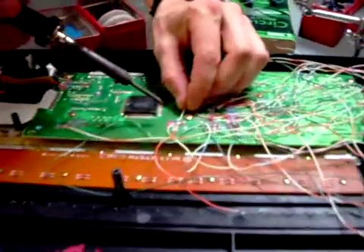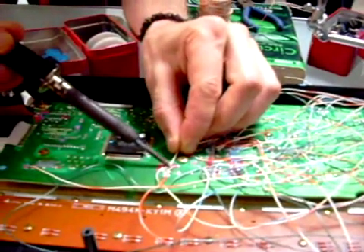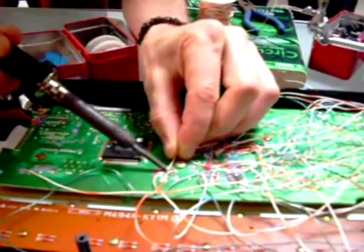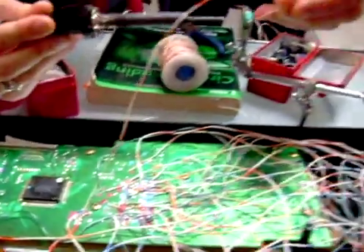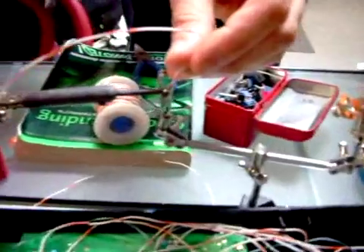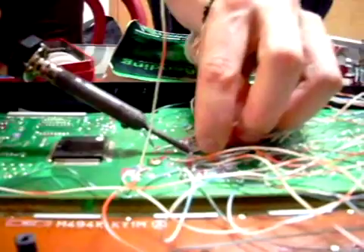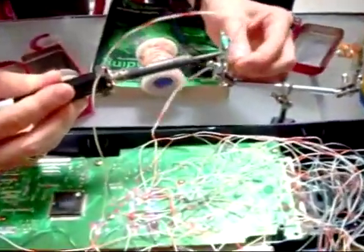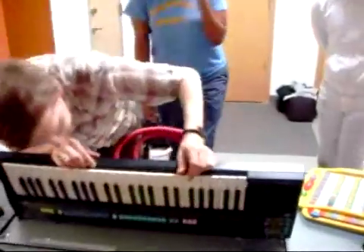I'm going to go back to point one. I'm going to reheat the location, bring the solder — there we go — bring the wire in, right there. And now you can see that it's hardened and solidified, so we've got a good connection. So now point one goes to one of these feet. I'm going to do that one, and then go back to the electronic circuit and reheat the solder that I had placed.